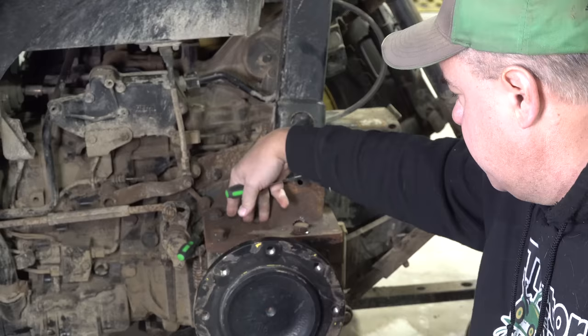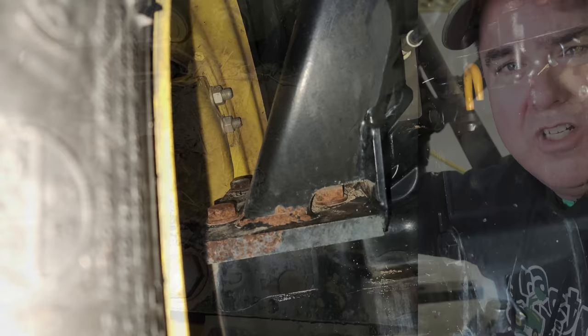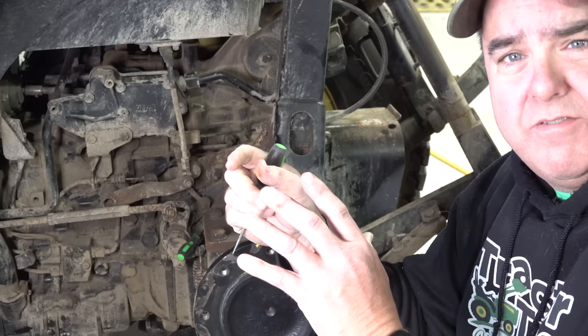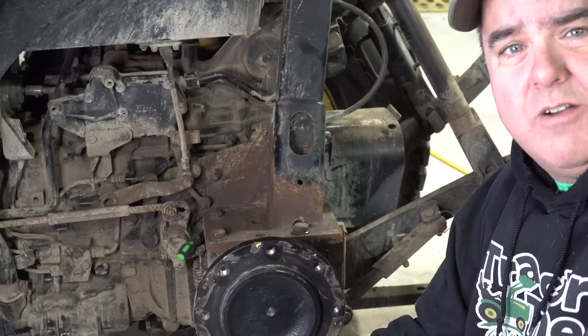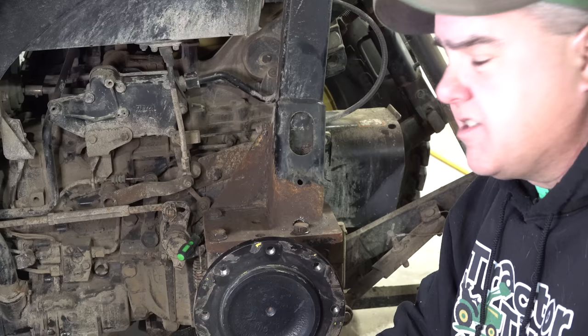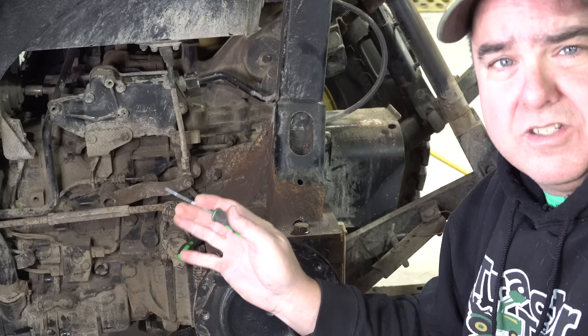I've got one photo from Tom and Randall's tractor. The tire's still on, so you can't get this angle. But all of this is definitely in better shape than in this tractor. Now, the left-hand side of this tractor, I believe, is worse than the right-hand side. I believe there was a spinner spreader on the back of this tractor to spread salt, and it would throw it toward the left-hand side and into the left-hand rim and then into this left-hand support here. Certainly the rim on the tire is much more rusted out on the left-hand side than on the right-hand side. So I'm hopeful I don't have the right-hand side all the way corroded through, but I think I'll still do the fix to both sides, if this is a fix.